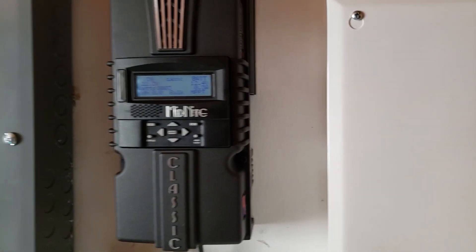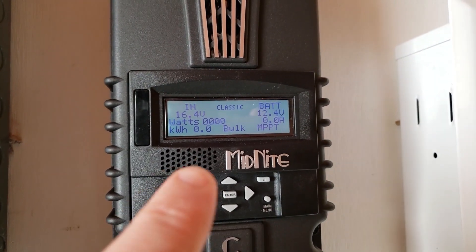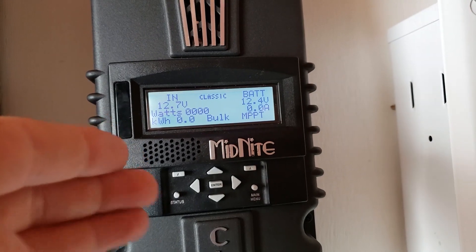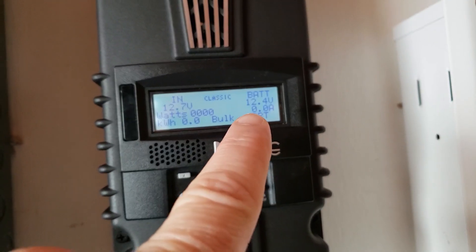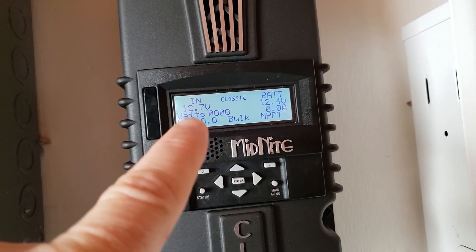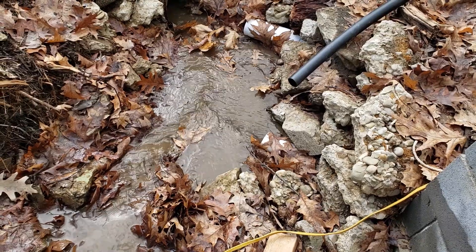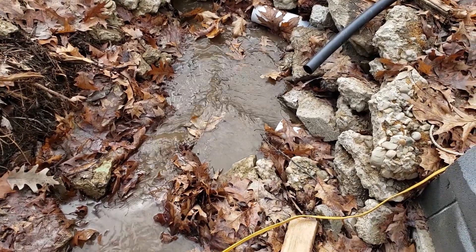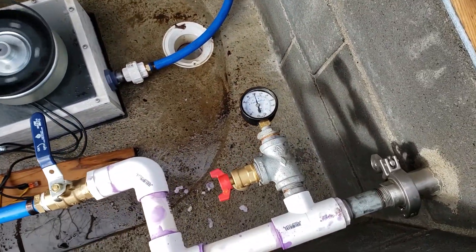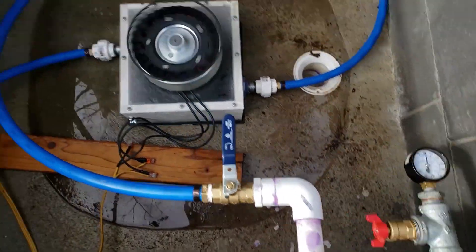I have a slight problem. Earlier the nozzle broke off, and now it's been fluctuating in voltage — it's not actually been charging the battery. It's still stuck at 12.4 even though it says it's in bulk MPPT. It doesn't have enough volts to work. Let's go look at the turbine. First thing I do is check the outflow to make sure there's actually water flowing out — we can see it coming out — and then we open it up and we're not getting full pressure, only at 100 psi. It's not spinning up all the way.